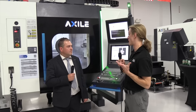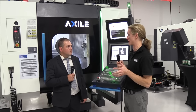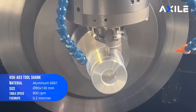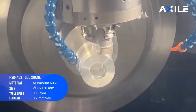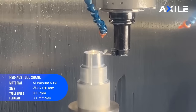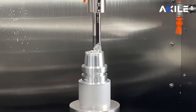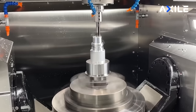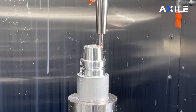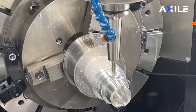Axile has a lot of smart implications and sensor technology, with the weight balancing being one of them. With the proprietary Smart Machining Technologies, or SMTs, one of them is SVS — Spindle Vibration Supervision. When the spindle has a certain vibration through the cut, whether it's a material a little harder in some area, an interrupted cut, or even an insert that broke, this technology preserves your spindle from creating any further damage. It measures the vibration, and when it hits a certain threshold it will automatically reduce the speed and feed to try to mitigate that vibration. If it doesn't resolve and it continues or amplifies, the machine will stop the cycle to prevent a crash or damage to the spindle.